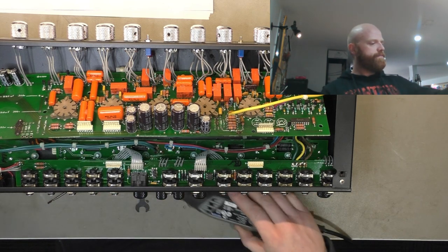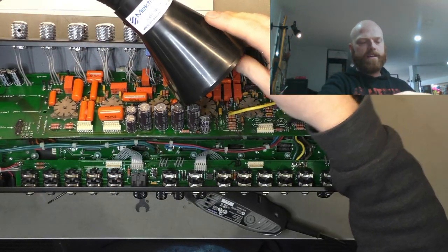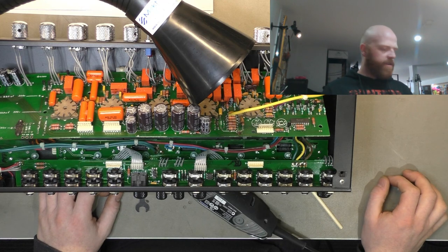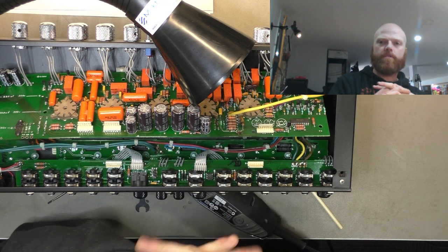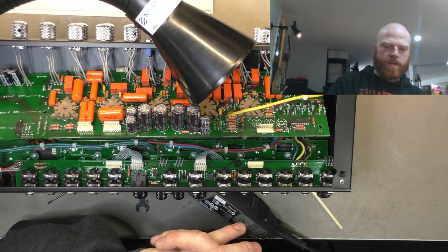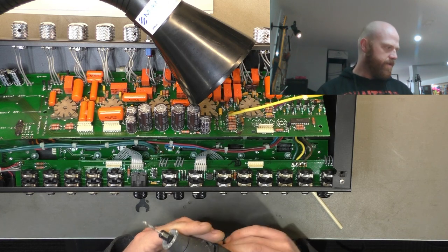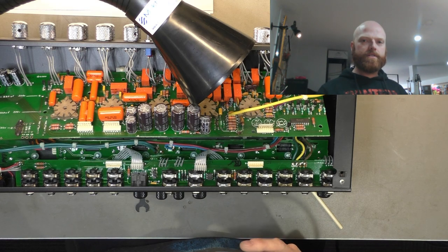So this will be fun. Fiberglass dust is not your friend, so I've got the buffer again. It's got a pre-filter, so it'll catch dust as well as chemicals in the carbon filter. The pre-filter is just a little layer of like Dacron mesh, so that'll pick up any chunks. And it's got the HEPA filter, so we won't be breathing in fiberglass dust because it's not friendly. So I've got that cranked up all the way, so it's probably going to be a bit deafening, but so is the Dremel, so turn your volume down.